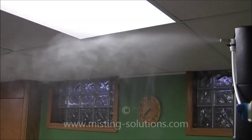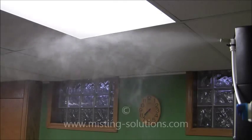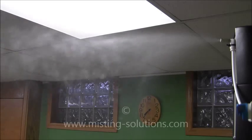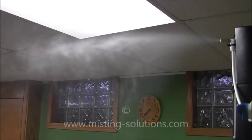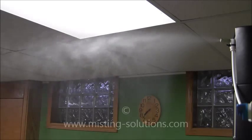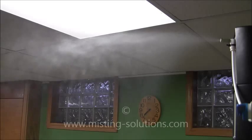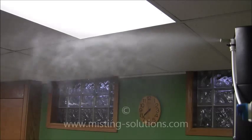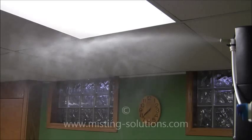Here is a 0.3mm nozzle running at 75 psi. You can see it's reaching out a little further yet with a larger, wider spray pattern. These nozzles are designed to run at higher pressures, so you can see on the tip it's trying to widen out its spray pattern — it's really about a 50-degree nozzle — but it tapers off pretty quickly because it doesn't have the pressure to sustain that. It does shoot out a good three to three and a half feet.